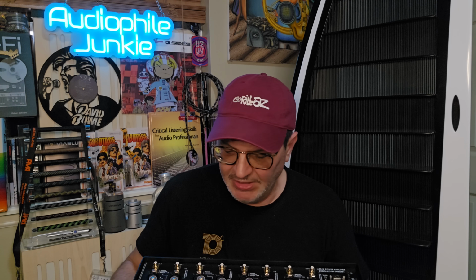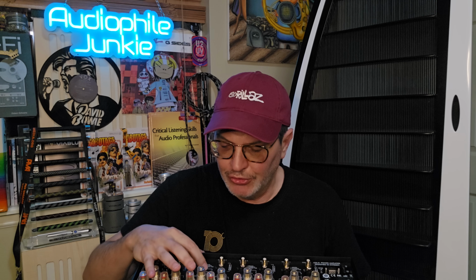But also what you can do when you bridge it, I'm going to hold it up again, see if you can read it, it'll allow you to change the gain in the amp with a 6 dB tab higher. There's 2 little dip switches, and it allows you to help gain match different speakers. I mentioned this in my SP25 review. Sometimes your center channel playing pink noise and level matching isn't matched to your mains or your rears. Your rears are much closer to you and they're louder, or they have different gain matching with amps and whatnot, and sensitivity of the speakers.